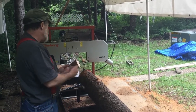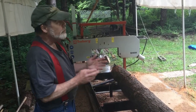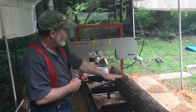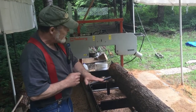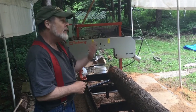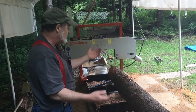But back to your question, when I'm milling, I know this is going to go into boards rather than 2x4s or 6x6 or whatever. So when I mill this, I'll be making nice, smooth, clean, hopefully, passes, and try to get 3/4, 7/8 inch, what I set my scale to, to get boards which I can then turn into bluebird boxes, bat boxes, et cetera.